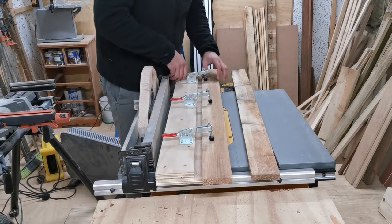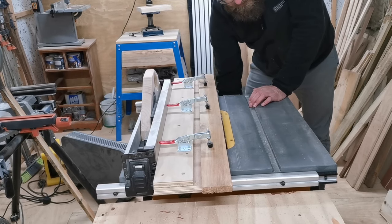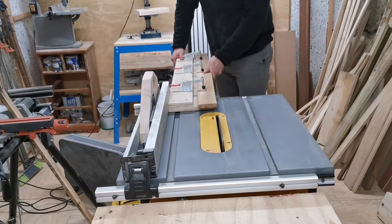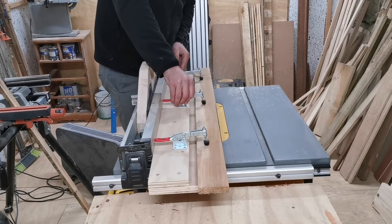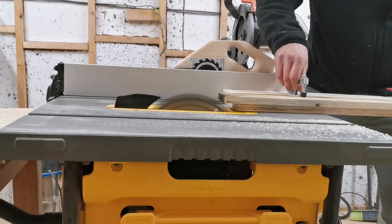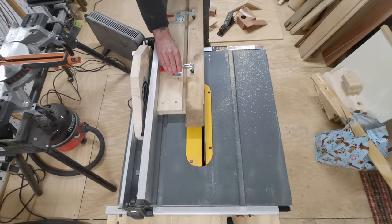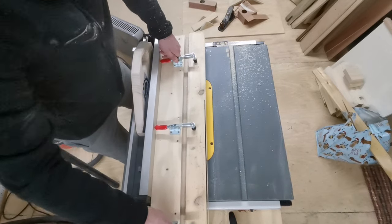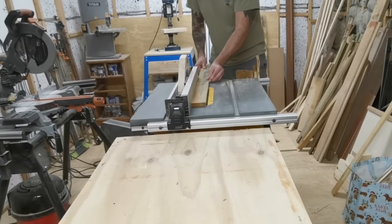After selecting my timber from my pallet wood stock I then go over to the table saw and use my jointing jig — which you can find a video link in the description below on building that — and I put a clean fresh edge on all the boards going to be used. This is the first time I've used the jointing jig extensively to straighten up a lot of boards and it did a really good job; all the boards were perfectly square, so I'm happy with the construction of that and I can vouch for it.